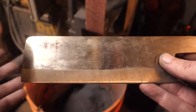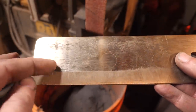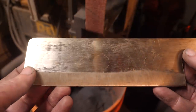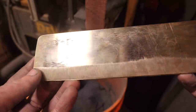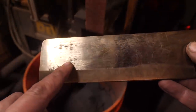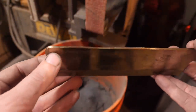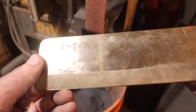That doesn't mean they won't stay in. They're really pinched in there with all the grooves and little micro aberrations and things like that. I doubt they would come out. And it's going to be very difficult to get them out at this point because this thing is hardened, and putting tooling on hardened steel is a big risk, especially when it's this thin. So, you know, I'm not anxious to just crack this open.